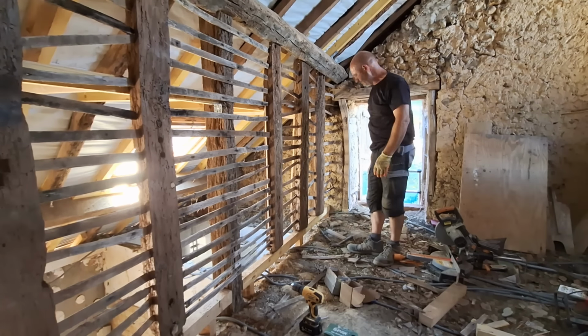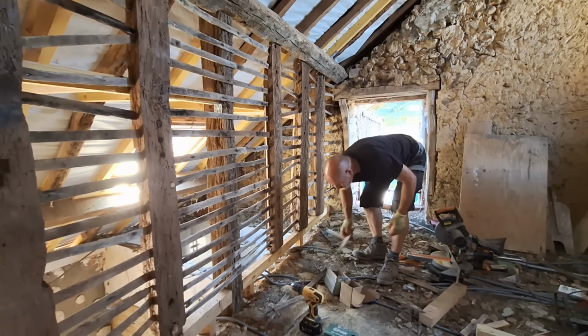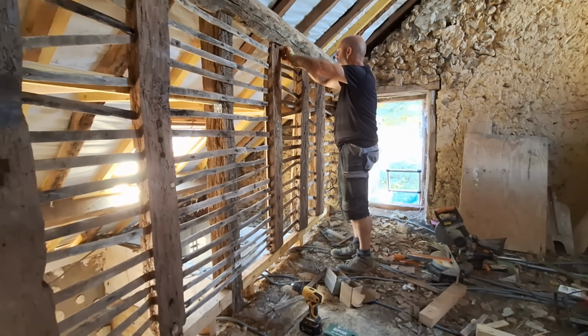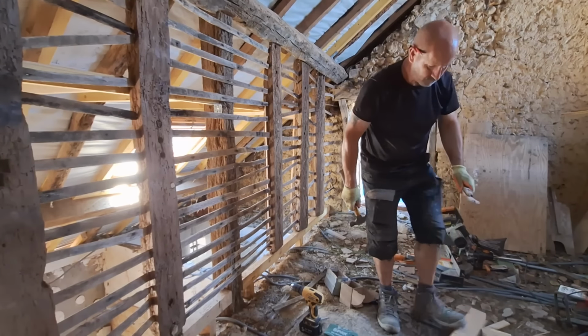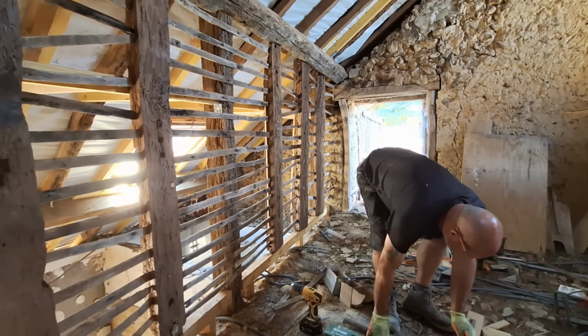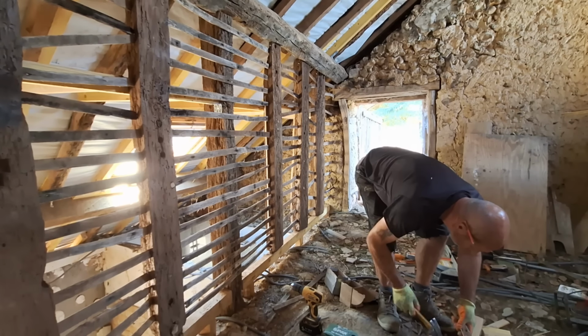What else to say on this? It will need to also be thinking about running electrics and stuff through, and connecting the soil pipe, which is obviously getting rid of the water from the toilet and the shower area. That's going to go probably below the floor there and run out in between the ceiling joists, and I'll cover that up and I'll insulate it so that you won't get the noise when you flush the loo or run the shower. The thickness of the floor there isn't sufficient to run it at the level, so it's better just to drop it and run it out.